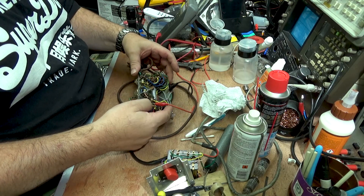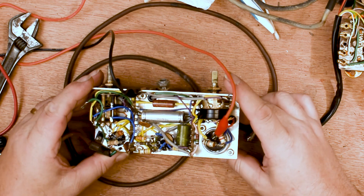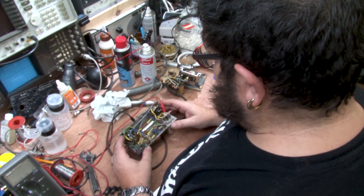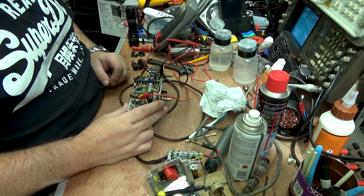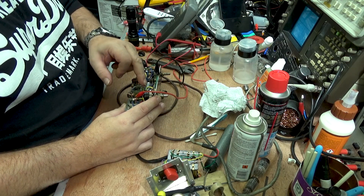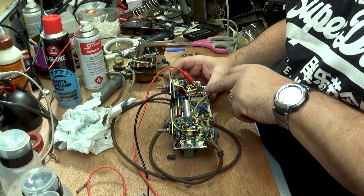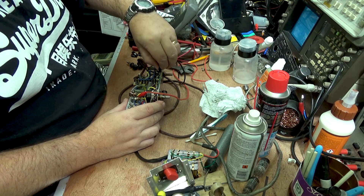Now as you can see there's a power supply connected up, and the thing's been sitting here. I've had it running at about 35 volts DC just to try and reform this capacitor because I don't have a spare. I've connected it into where the voltage would come in from the rectifier, so all three capacitors are actually getting charged and reformed. They have been like that for the last 24 hours, so that's been sitting there cooking. I've got the soldering iron warming up, and what I'm going to do is shut down the power on that now and take these clips off.